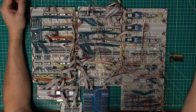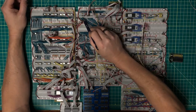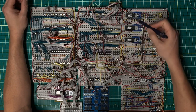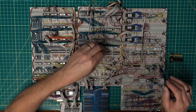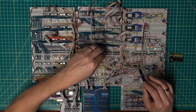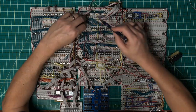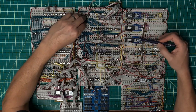Let's get into the meat and potatoes: converting from an 8-bit instruction. Currently the 8 bits of the instruction are here on the instruction register, picked up before the instruction register itself is latched — to give the EEPROMs enough time to decode. I've got 4 wires coming up to demultiplexers which ultimately indicate which registers get to assert to the bus. These will now have to be driven off of some other piece of logic. These 4 bits need to be relocated so they can be part of the decode logic for the EEPROMs.